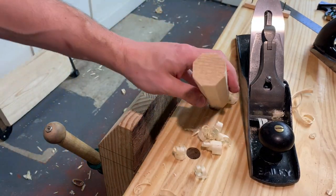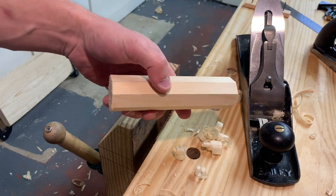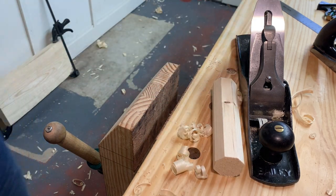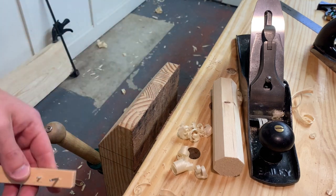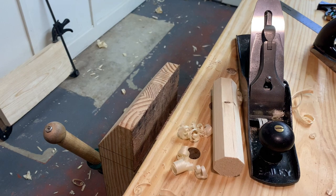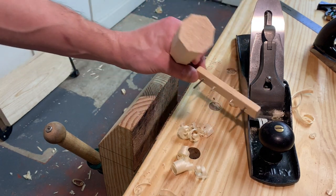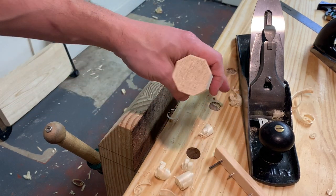Here's the final result. It's pretty close — with a little more care and evening everything out, I think we're good to go. That's a really quick octagon, about five minutes of work, not even. The great thing is it can do tapers as well because you just keep the pressure on the side and keep twisting it, and it'll follow the ratio. It's not about the measurement — it's the fact that these guides keep the ratio. So if you need to octagonize, you can use the octagonizer, also called a spar gauge. Hope this has been helpful. Thanks for watching, and see you around for the next one.